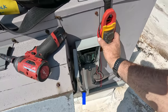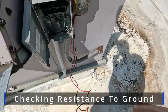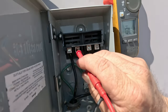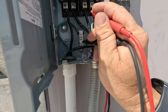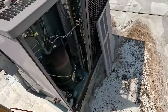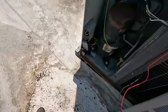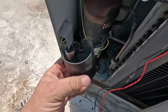Let's check and see if we've got anything to ground — do a generic check on the load side. The contactor's not pulling in, so probably not going to get anything accurate here. Nothing there, and nothing there. Going between them you should have something — probably the motors. There's 84 ohms. Let's go over here to the compressor. That's the heart of the unit.